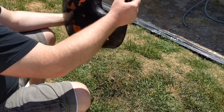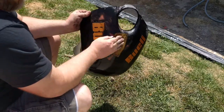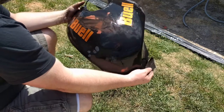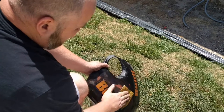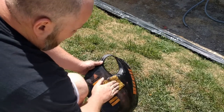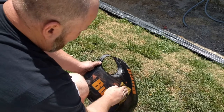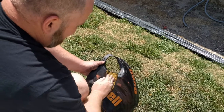I'm just trying to get rid of the high spots so that the low spots aren't so apparent. And you see how I'm swirling? That's a no-no - don't do that. I'm just doing it because I'm trying to get through this faster. You really should be going in a nice, smooth, linear movement, light pressure, taking your time.